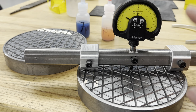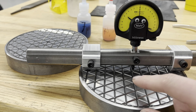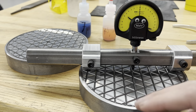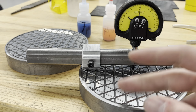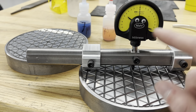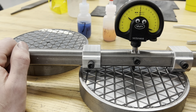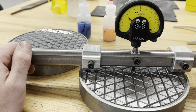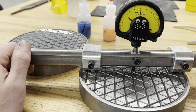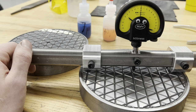Let's take a look at how flat these are. We've got the spherometer leveled on one, and this is how I was measuring them in process as I was lapping them to each other. Like Robin says, you don't need three plates to make something flat — you just need two and a twist gauge or repeat-a-meter or something to compare the relative curvature between the two. So I would just measure which one is concave and which one is convex, and put one on the other until I got it in close. There's a little bit of hysteresis in the indicator here — as I pull it forward it's right at zero, and as I push it backwards it goes down to negative 20 millionths. So to keep things consistent, we're going to measure as I pull, preloaded towards us, just to make sure we're not catching any of that weird hysteresis in our measurements.